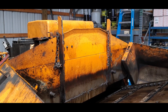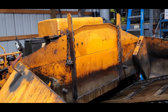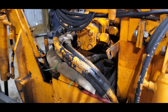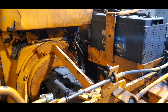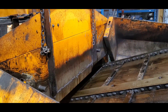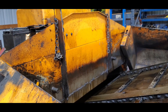The third or fourth thing I would change is how this is set up. Behind this panel here is your oil filter, your fuel filter, all of your fuel lines, hydraulic lines — mainly the main components of your power unit — and you can see how compacted everything is in here. It's very difficult to work on this thing on the job if something goes wrong, and it's also very difficult to change the oil. If this panel was removable, or could slide up between these two pieces of flat bar, you could access the critical components a lot easier.